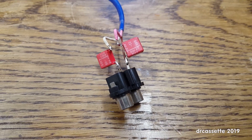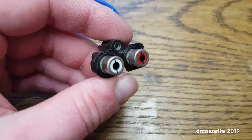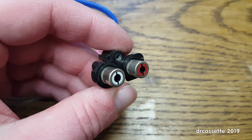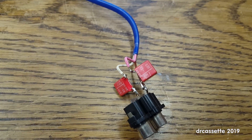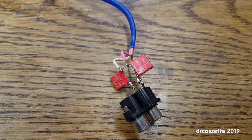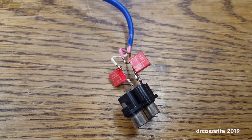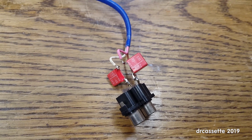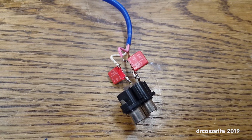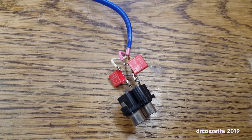I have now finished making the new input circuit. We have two RCA jacks — these used to be the phono input jacks. In series with those, we have two 680 nanofarad foil capacitors. These are coupling capacitors to keep out any DC. This may be subject to further experiments; I know it's not ideal right now, but these are the best I could find.